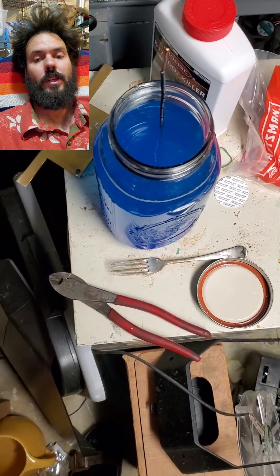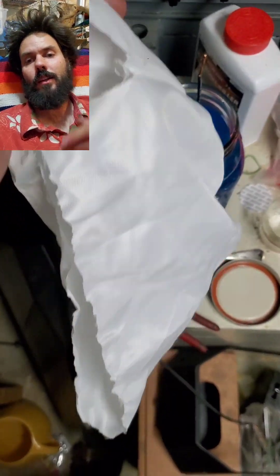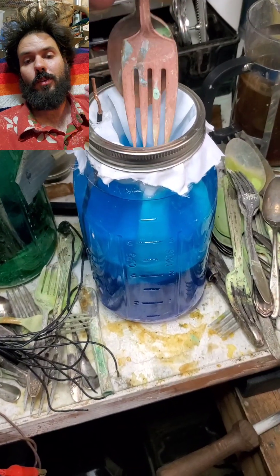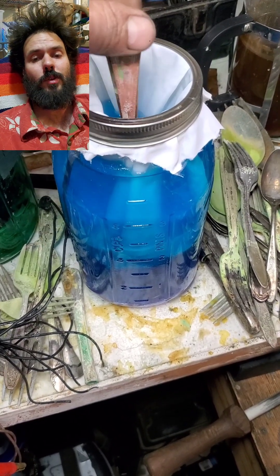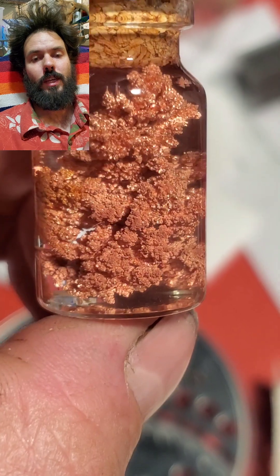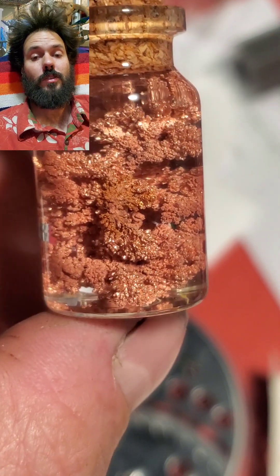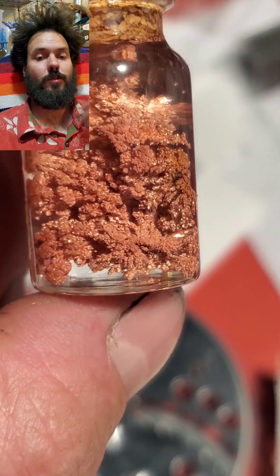That led me to put together a plating cell using copper sulfate and too much voltage. Basically this stripped the copper out of the brass spoons and deposited it onto a cathode. I had a lot of fun with it — I made cathodes out of pyramids, played around with different kinds of dendrites, and put them in jars because they're actually really pretty. You do get crystal copper forming on your cathodes, and it would process out the copper from the brass spoons.